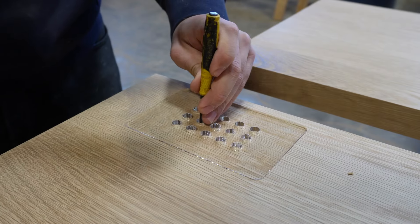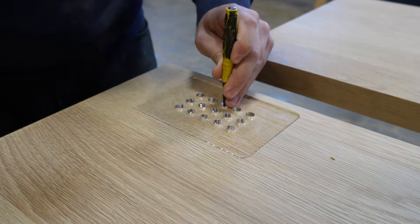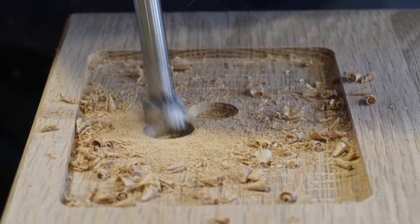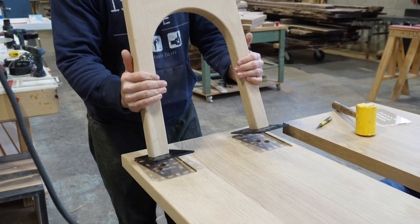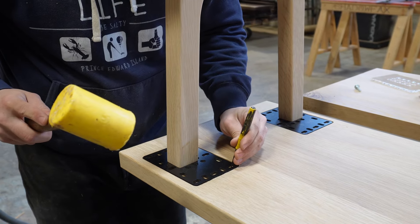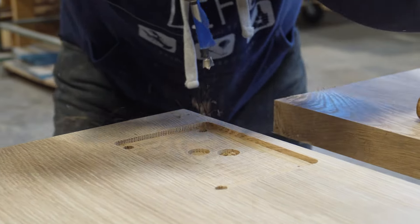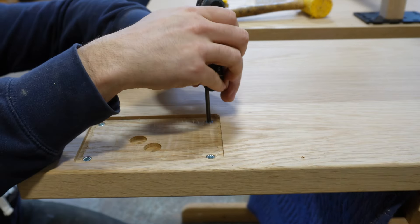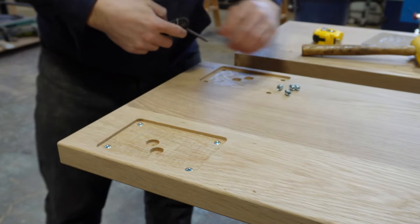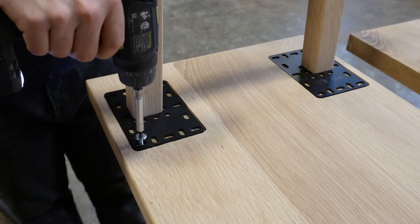Use the original layout tool to mark the holes used to attach the plate to the legs on the underside, so you can drill a small pocket to receive those bolt heads since they sit proud rather than flush. Then pick which holes you'll use to mount the plates to the underside of the table — you can use four, six, or even three, though we normally go with four based on what's going on underneath.